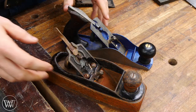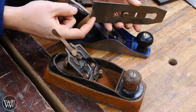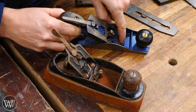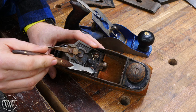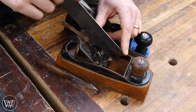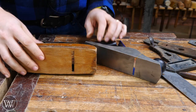One of the biggest differences you'll notice is that on the steel planes, the frog goes all the way down, and the nice thing about that is it supports the iron all the way down to the backside of the bevel. The sole at the very tip doesn't actually touch the iron, so you can move the frog forward and backward to close up or open the mouth, because the frog supports the iron all the way down to the edge of the bevel. On the transitional plane, the frog stops partway down, so you can't move the frog forward and backward to close up the mouth. If you move the frog forward, nothing will be supporting the iron all the way down, and your blade will start chattering. That's why you want to make very sure with a transitional that your frog is perfectly in line with the wooden bed below, so the wooden bed is still supporting the iron.